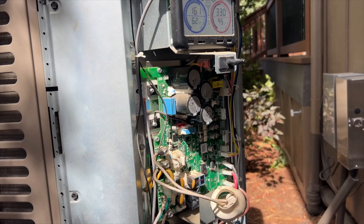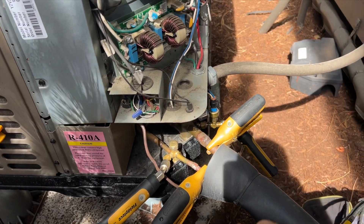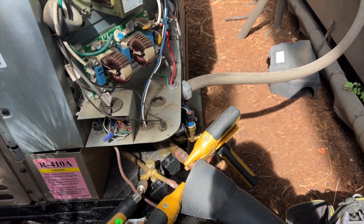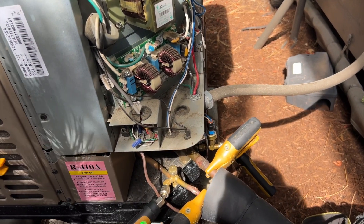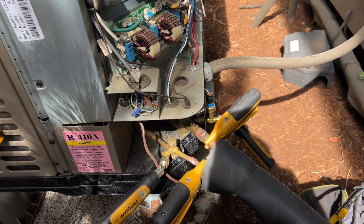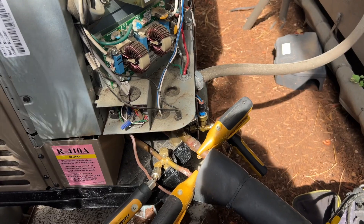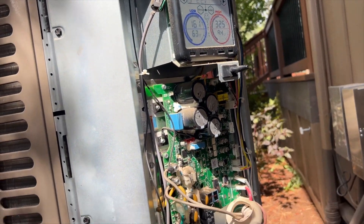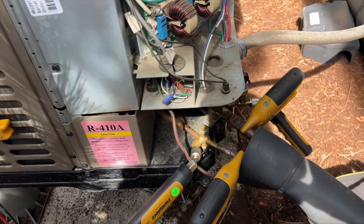Apparently they've been having this problem for like a year. They called that other company out, and they diagnosed a bad pressure transducer — which it probably was — and then they installed it on the discharge. It was giving the same error code, so they probably just cycled it in cool. In cooling mode it's fine, but then in heat mode it just cuts off and calls for auxiliary heat. That's why the homeowner didn't really care about it so much — they still had heat — but they did notice that error code was constantly on the stat. I think we fixed it.